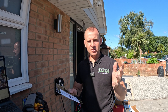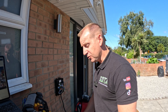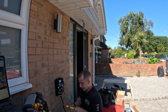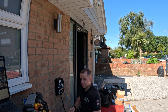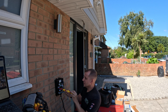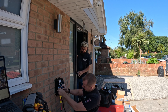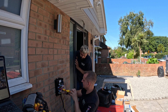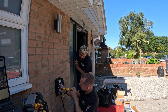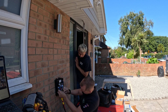Now I need to terminate my cable into the charger. The quick start guide specifies that cable terminations must be done up to 2 Newton metres, which I'm going to do now using my torque screwdriver. It's really important to follow the manufacturer's instructions because it maintains the warranty you're issuing your client with. Two Newton metres is tighter than some other chargers — surprisingly tight. The connectors inside the Hypervolt are absolutely mustard — really really good. Some other brands put cheap connector blocks in there which I really don't like.